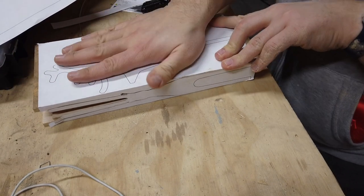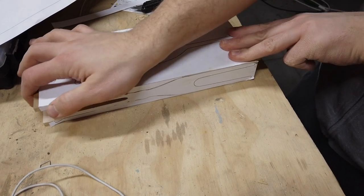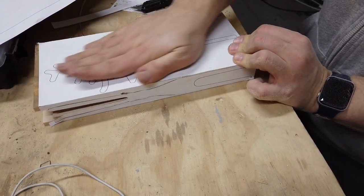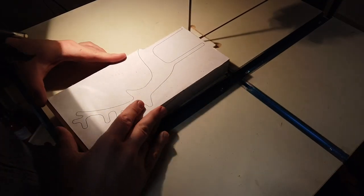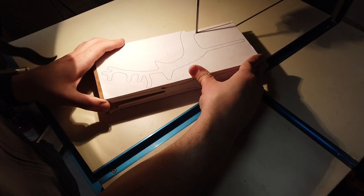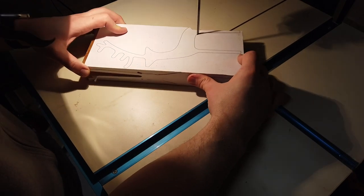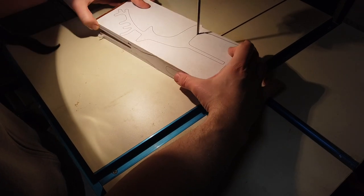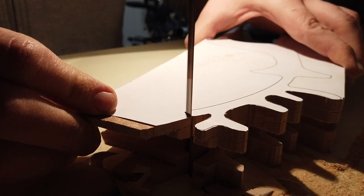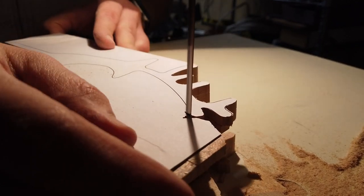As a quick note, the reason we need to glue the cutoff pieces back on is to provide a flat face to use on the bandsaw table while cutting the other face of our template out — not to mention that one of the pieces has the other piece of our paper template glued on. So after they were glued back on, I could cut the other face. This dimension is definitely easier to cut, as the blade isn't going through nearly as much wood at once, giving you the ability to move a little faster and turn a little easier. I again hugged my line as smoothly and cleanly as possible, and any areas that were too tight to turn cleanly, I did mini-relief cuts to make room for the blade to change directions.